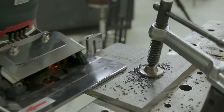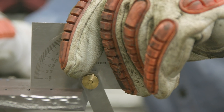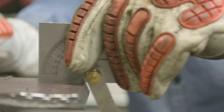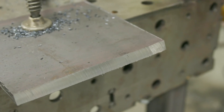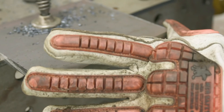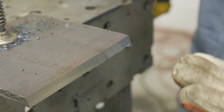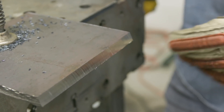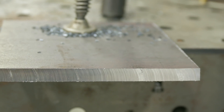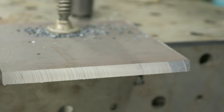So as you can see, we've got a nice clean cut here. Let's go ahead and check the accuracy of the bevel — it looks like we're right at our 22.5 degrees, so we've got improved accuracy overall. Speed seems to be a lot better, and compared to using a grinder, I'm not wearing out my arms all day. If you have longer sections — this is just a six-inch coupon — but if you have 15 or 20 feet or better of weld, I would highly recommend using a nibbler over a grinder or even a track torch. This is going to be much faster, and I have less cleanup to do afterwards. All I have to do is remove the mill scale, clean up the back, and we're ready to go.